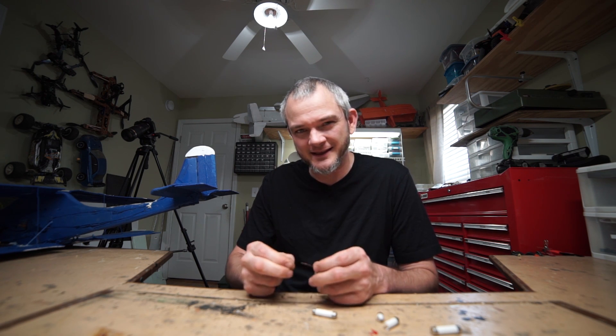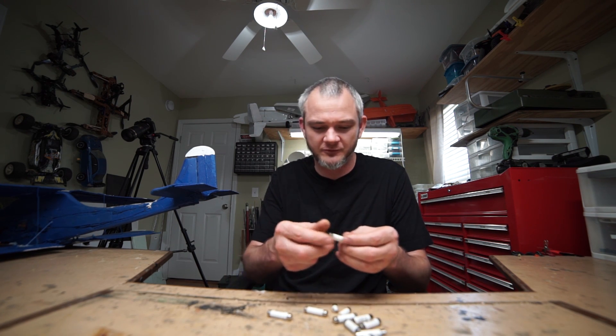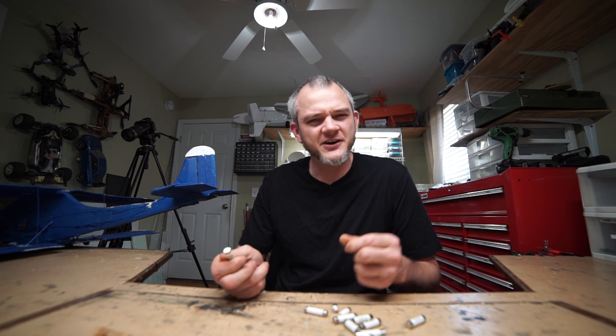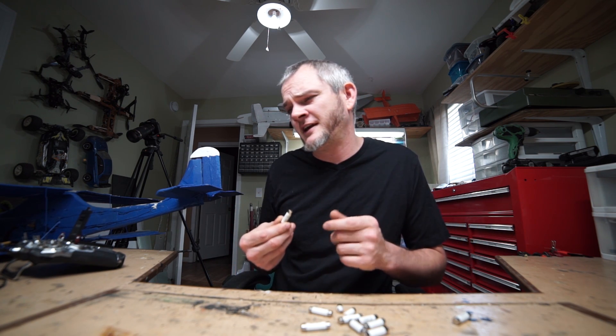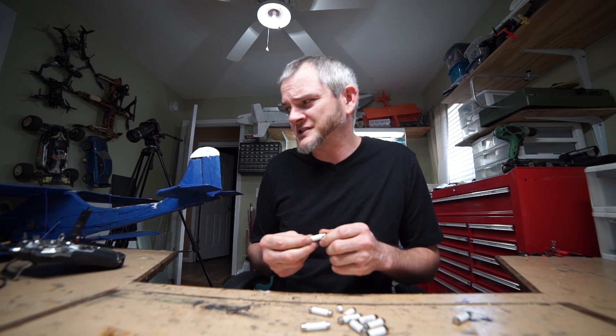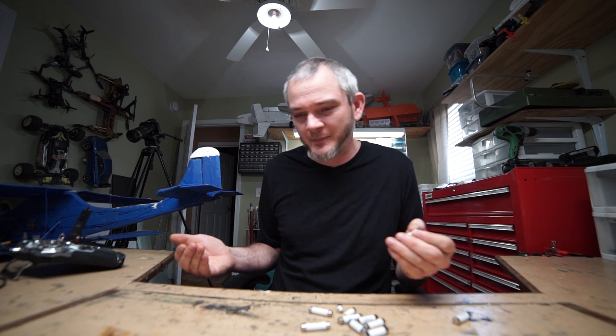So I decided to test them. I've got about eight different sizes — three amp, two amp, one amp, all the way up to 32 amp. These are supposed to be fast blow fuses, which means they should blow almost immediately after an overcurrent condition. A one amp fuse should blow right at one amp, and with a fast blow fuse it should blow within milliseconds of exceeding that current limit. So if this thing actually worked, we should see it blow immediately after we pass one amp. Let's see if we do.